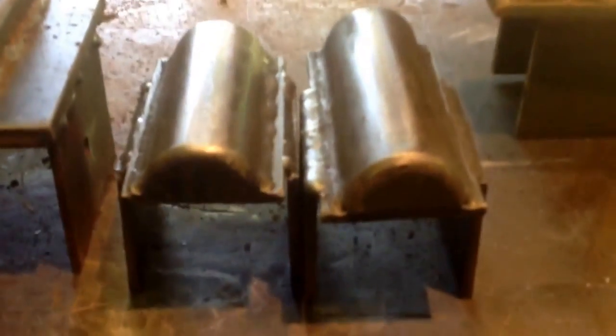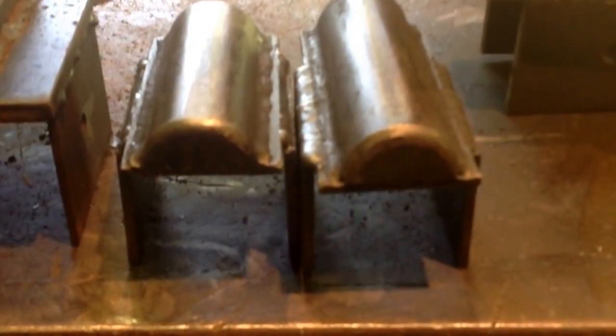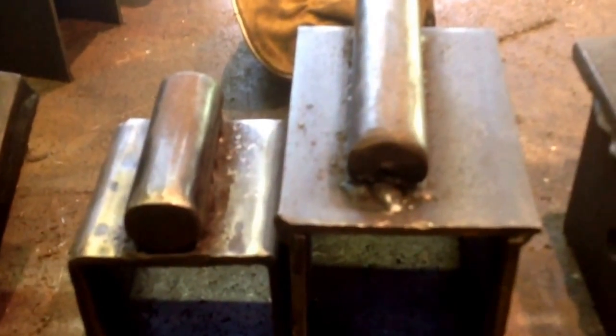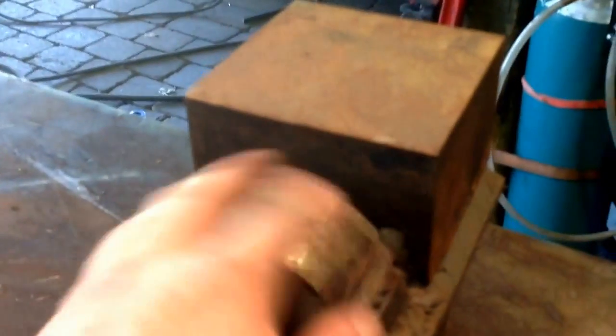Here are the dies that I've made in two years. These are about three-inch fullers — I have a set of these, top and bottom. This is a very sharp, about half-inch fuller, and inch-and-a-quarter fullers. This was the bottom die only for forming a radius into a piece of flat, and then I can bring it up here and work it on the flat.